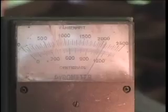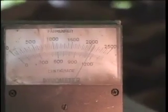Almost problem free. We had a little glitch sometimes when you're going up. It sort of hiccups a little bit, and so we were up at temperature in the firebox. We were at 23, and next thing you know, we were at 1850, which is a kind of a severe drop. Nothing broke as a result, but we had to drive it back up. Sometimes it chokes, it needs oxygen. So the little holes that you see there, the primary air holes, sometimes get clogged up, and it'll drop fairly rapidly.